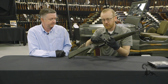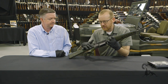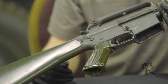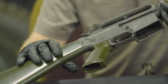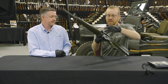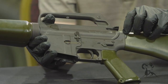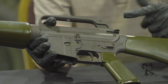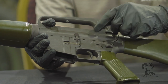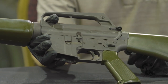Looking up front you have the non-captive front pin and slab-side lower receiver — this one's a little marred up unfortunately. You have the classic grip, which you could really call a 601 grip since this style predates everything else. The trigger guard stayed the same — it's the same trigger you'll find on an M4 carbine today. The bolt catch is also very distinctive to the 601: it's kind of cut off at the bottom, so there's no raised portion, making it a little more difficult to reach in and lock the bolt open.